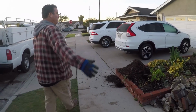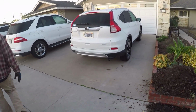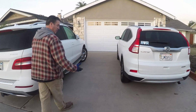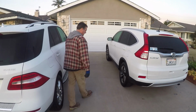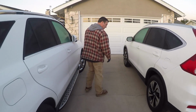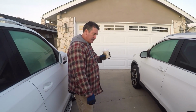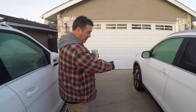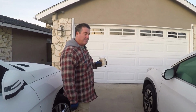Then we're going to remove all this driveway. The whole thing's coming out. You can see the driveway has done really well, about 40 years or so. There's no steel reinforcement in it. There never is on the original builds, and there are no control joints in this. That's why you have all the cracks just randomly wherever.